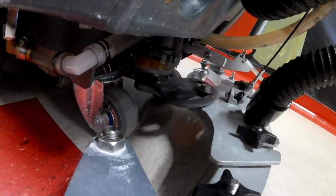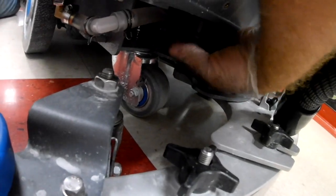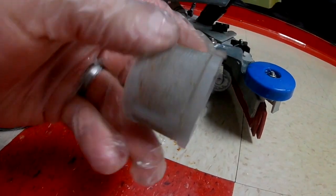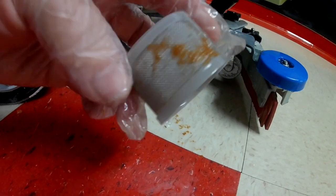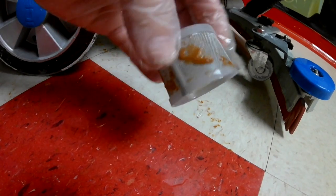You kind of have to locate those — some are up front, some are in the back. Get your owner's manual out. Most of them just twist off — there's going to be some water right out here. You can see all that rust and debris that came out of that filter. If your machine quits feeding water, that's rust and soap scum buildup that gets on these filters.